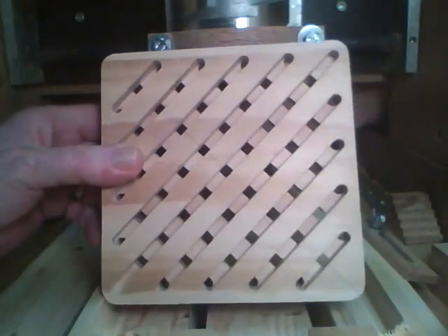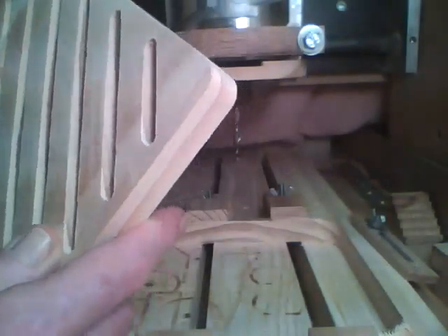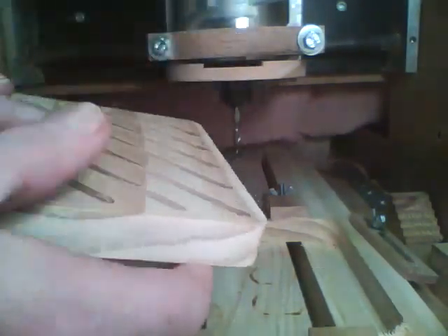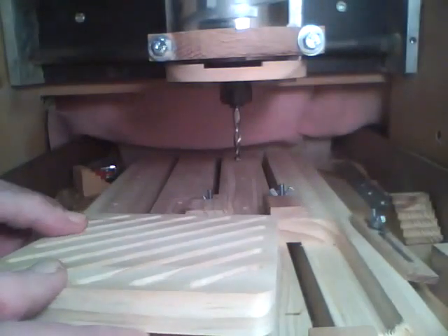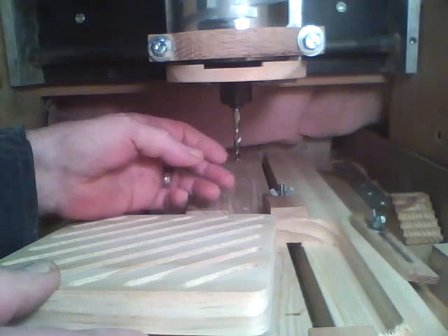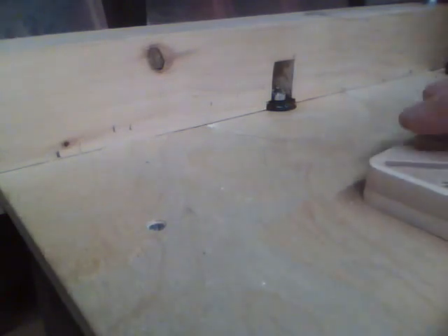Here's the finished project — well, almost finished. A little light sanding and that'll take care of it. All I need to do is run it around the router table here, put about a 3/16th radius on top and bottom, and a little sanding and it'll be all set. I was getting some chatter — I think the cutter was too long and it should have been shorter. Okay, now over to the router table.